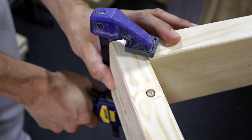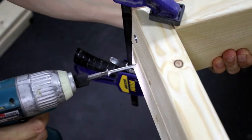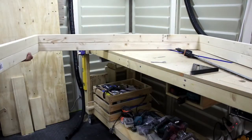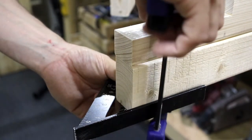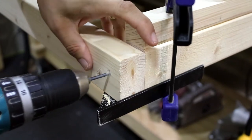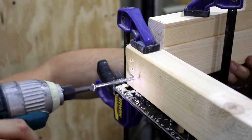Then I started to assemble the structure. I did not use any glue — the long screws hold the timbers together quite strongly. A simple trick that helps hold the timbers while screwing them together is to clamp a speed square to one of them. This not only helps with holding them, but the pieces will always be flush with each other. It is very important to note that before screwing them I made sure that each of them was exactly 90 degrees to the other.